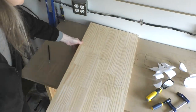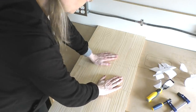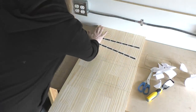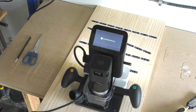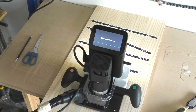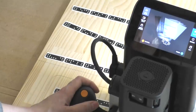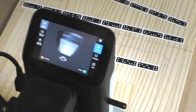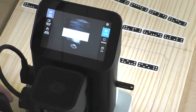I'm gonna press down the board to the sacrificial surface to make sure it's stuck down good and proper so it's not gonna move around. Then I'm gonna put these guide tiles on—the Origin uses these tiles to align itself and to create a virtual work surface onto which it will work. Here's the Shaper Origin powering up. The very first thing I have to do is take a scan of the work surface to create the virtual work surface, so I'm gonna start a new scan, moving the Origin around. The camera mounted on the backside is pointing to all areas of the work surface, seeing all of the tiles, and I'm also being very careful to scan in all of the pencil lines I've drawn to get them into the virtual work surface.